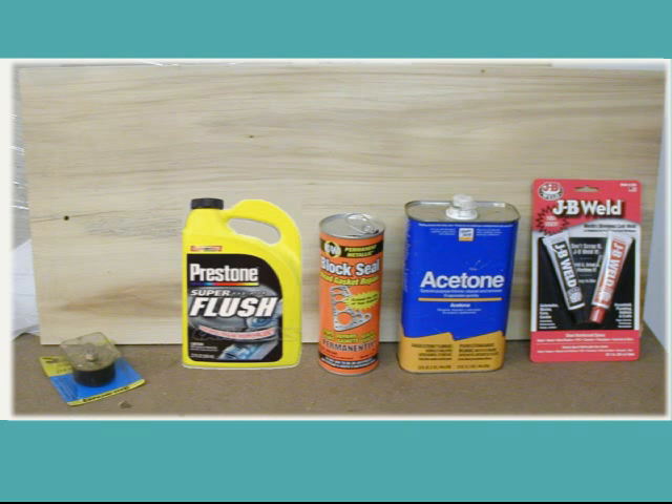I bought this Onan 3 EK12 lead generator for about $600 at a local auction. It's an intermediate size generator for my eventual wood gas electricity for the residence project. It's a city water unit, so it has no radiator. Since it's a city water unit and it has a water-cooled exhaust manifold, that means I can heat the house with the generator on the days that I run it, which is really beneficial.